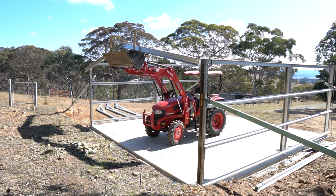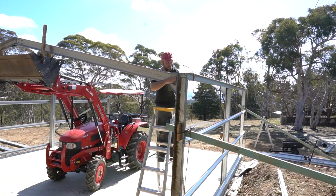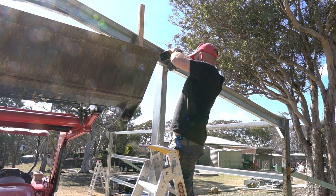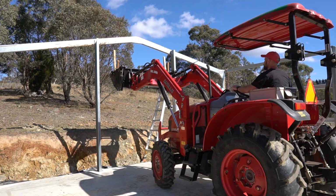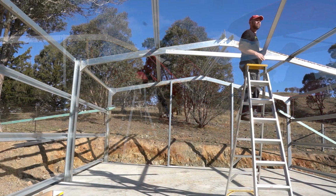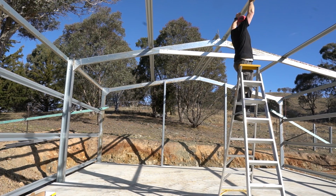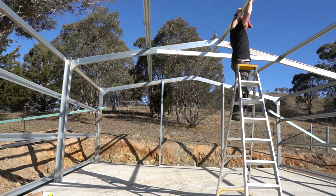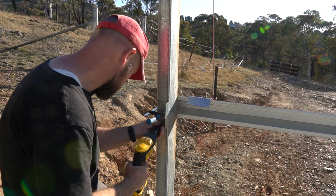Next step is lowering the trusses into the haunch brackets and tightening the bolt just enough to hold everything in place until the end mullions are plumb and secured to the end wall truss. Then add the remaining trusses. I get the roofing top hats in next, which really starts to hold everything together. The last framing step involves adding top hats to the end wall using angle brackets, since these mullions are flush with the slab's back edge.